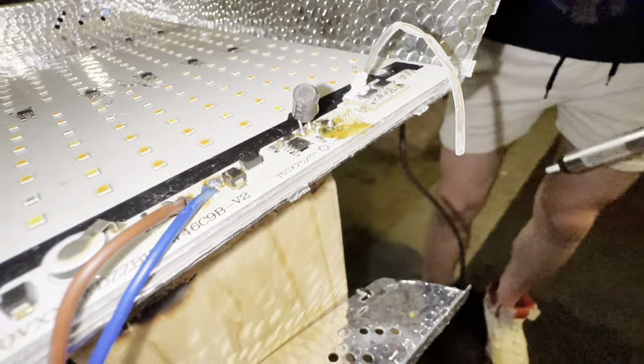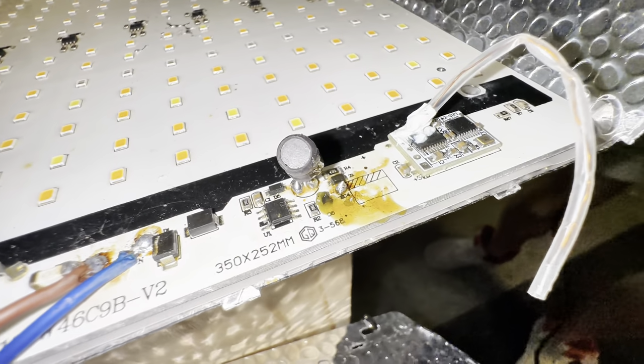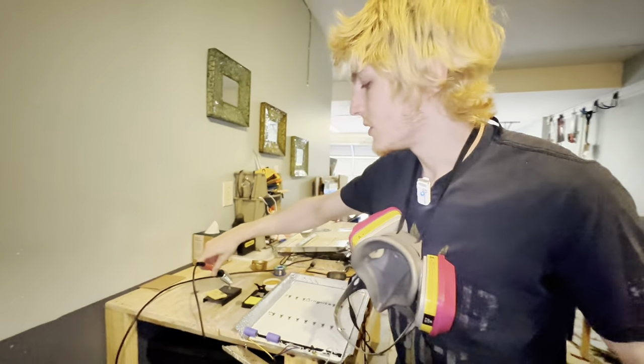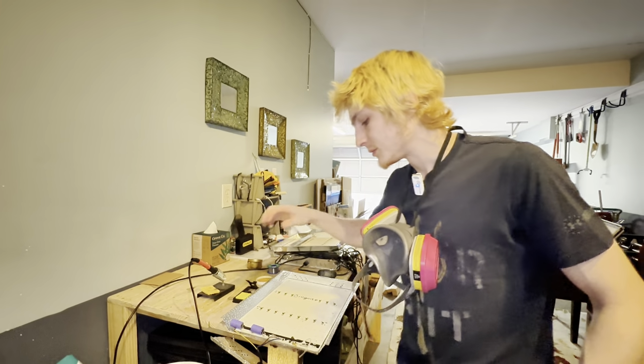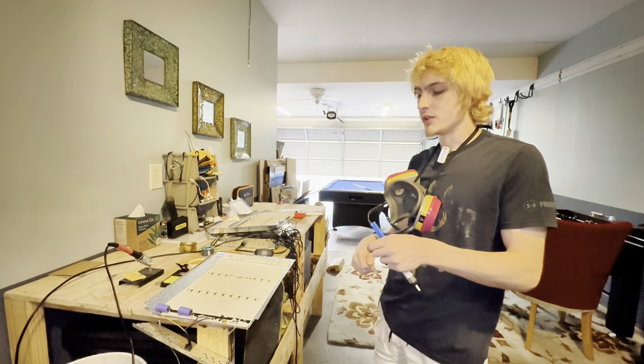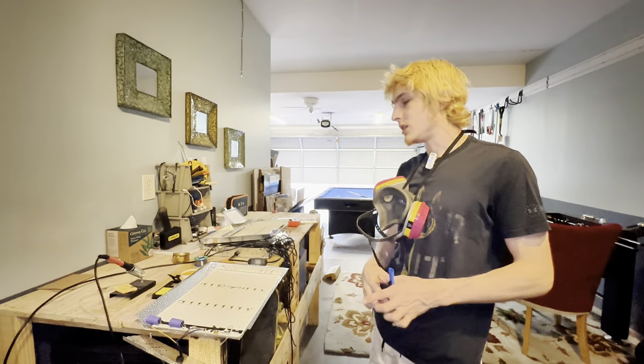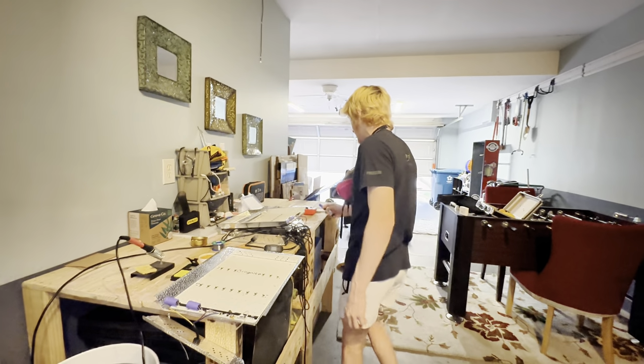I'm going to liquefy long enough. Actually, I'm going to keep that metal lead connection. So, you can reuse the old connections. I just wanted to get the big chunk out of there. You can reuse the old metal connections because it's just old solder. It'll even solder in there easier if there's an old lead connection on the PCB. So we're gonna leave that connection there.